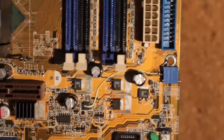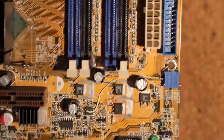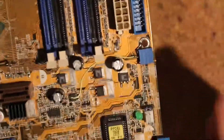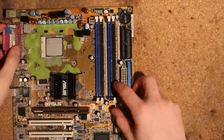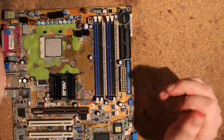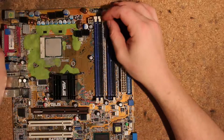While we're at VMAM, this is a VMAM mod — a variable resistor connected to what is actually a linear regulator, so the feedback pin is more like the negative bias of an op-amp in this little chip. Anyway, it functions the way normal voltmods do: lower resistance gives higher voltage on the memory. Unfortunately the memory VRM on this runs off 3.3V, so the maximum will be about 3.2V. If you want more, maybe I'll do a mod on one of these boards, but so far I haven't figured it out. If I wanted more, I'd just run an external power supply.